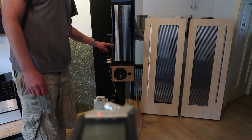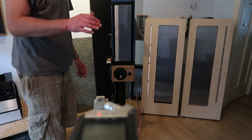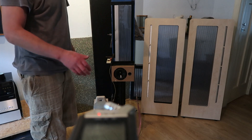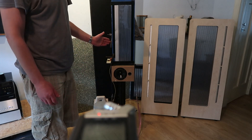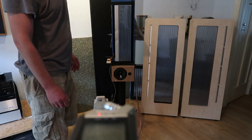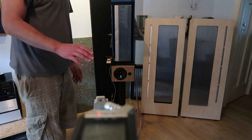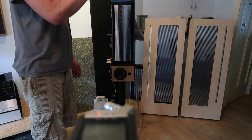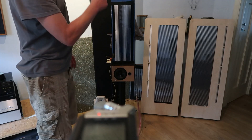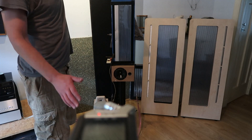Putting damping behind the tweeter reduces the 1K range a little bit, which is nice because I have a kind of drop-off in the ultra-high or higher frequencies, especially from 16K. I had to implement an EQ curve that does a kind of whoop-dee-doo — a lift of around 3.5 dB or so in that region.